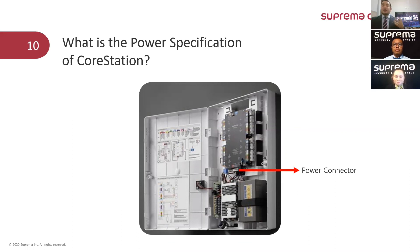This means that if we are trying to attach more than one slave to the CoreStation, each of the slaves should be powered by their own power supply. And please remember to connect all grounds to a common point to avoid irregularities in the voltage or current.